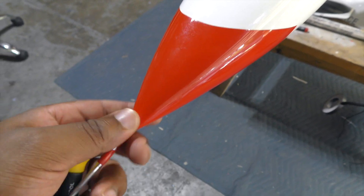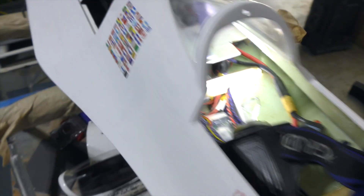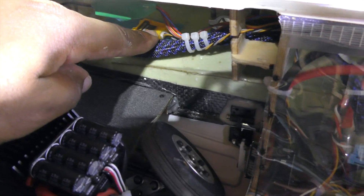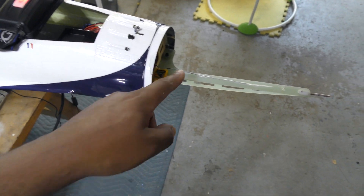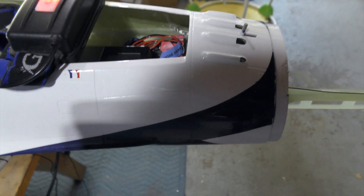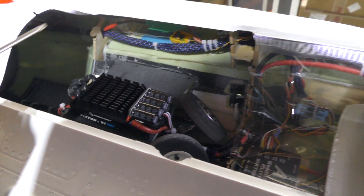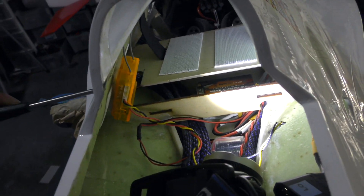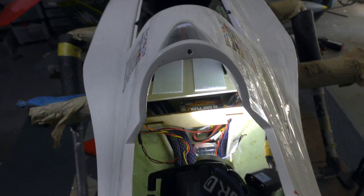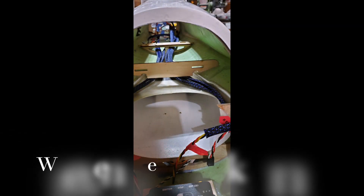There's one satellite right there in the nose, and the second satellite is right here on the wing. So essentially we have a receiver here, a receiver here, and a receiver all the way in the nose — and they're orthogonal. You can see the antenna here goes one way, the second antenna goes the other way. Similarly, on the midsection, one antenna moves back and another goes in that direction. The goal is to ensure as much orthogonality as possible on the receiving end.